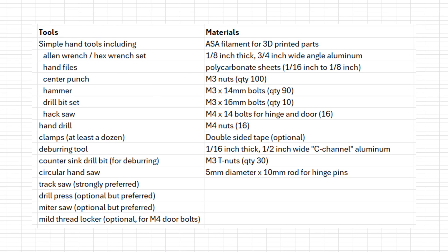For this build, the tools you'll need are mostly straightforward — I'd consider the majority common for a DIYer, with the notable exception of the drill press and the track saw. You can absolutely get away without a drill press; a hand drill will do fine. Even without a miter saw, a hacksaw works, just with a little extra elbow grease. The really important tool was the track saw. If you're using eighth-inch thick polycarbonate, you'll need something that can slow down the blade speed. A jigsaw with speed control might work, but do some test cuts first before jumping into the full build — the polycarbonate is one of the higher costs, so you don't want to damage it.